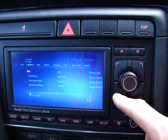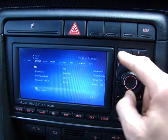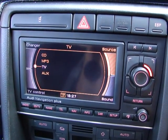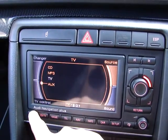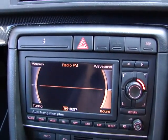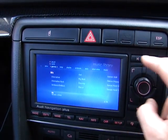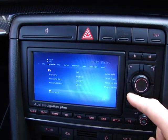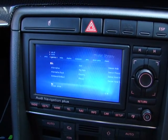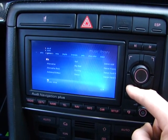The buttons available in TV mode are: lower left, upper left, wheel left, wheel right, pressing the wheel button, back and track forward, return and set up. Other buttons, like the ones on the side, activate features you'd already be used to. I've got these buttons mapped to up, down, left and right on the keyboard. So when I press these buttons, the CAN bus adapters pick up the message being sent and the corresponding keystroke is sent to Media Center.